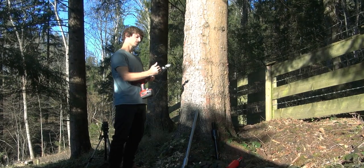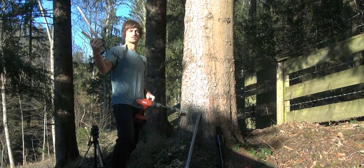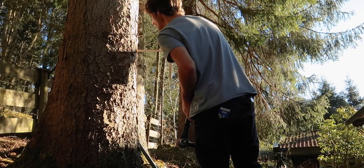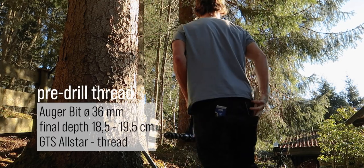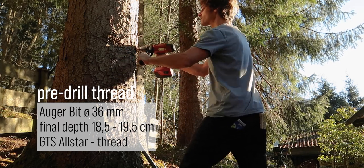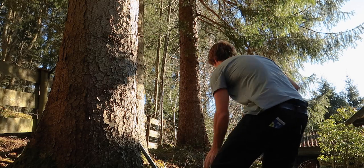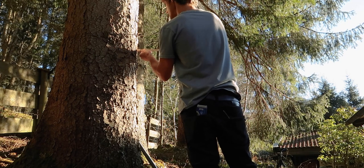Then when you've reached the end of the auger drill, you can start checking the depth of your borehole, which should be 18.5 to 19.5 centimeters with this model of the GTS Allstar. Now it's 15.5, means you need to go in 3 more centimeters. So that should be our final depth. Yeah, we have 19 centimeters,